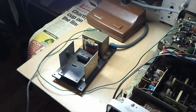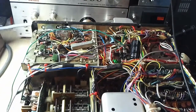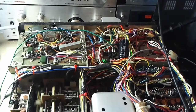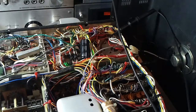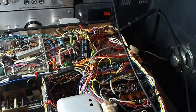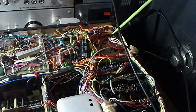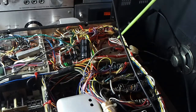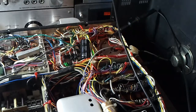I've substituted another transformer for the 12-volt supply after the shenanigans with the half-wave rectification. We're having a look at the ripple. There are two positions to measure the 12-volt supply. Where the oscilloscope probe is at the moment — where the white wires are — that's coming straight off the first filter capacitor. It then goes through an inductor onto the second filter capacitor. This is the very filtered 12-volt supply.